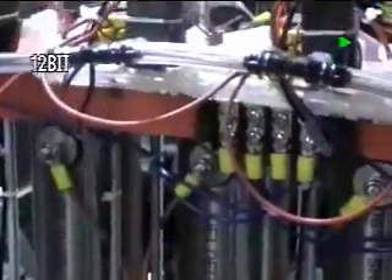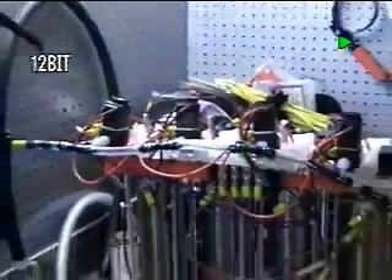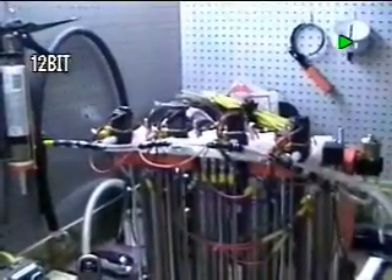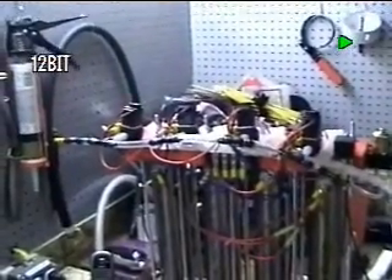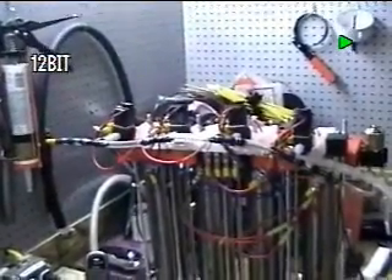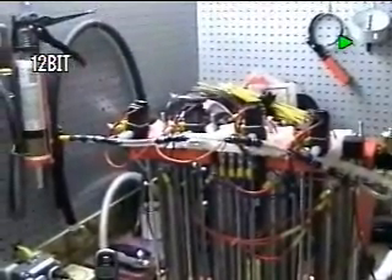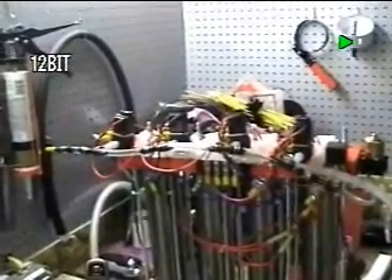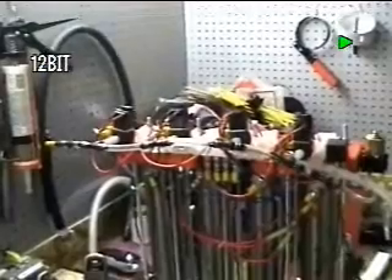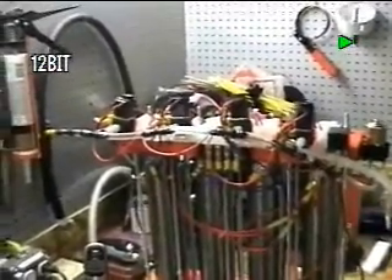The way you fill these up is you don't charge each cell individually. You put your potassium hydroxide into a gallon jug of distilled or filtered water, you mix it — we give you the instructions — and then you just pour that into your actual reserve tank and let the system pump it in and fill it up automatically. Then you take the balance of it, top it off, and put the remaining leftover water, which is about a quart, away so you can use it to top off your tank any time you need to.